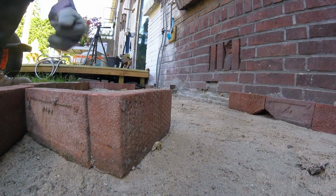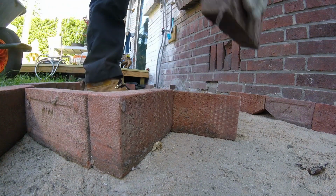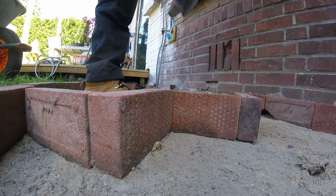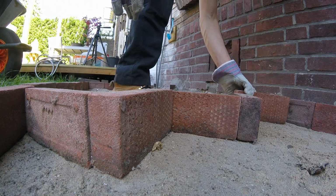The pattern is the center line of the whole job, and to check the sides how much you want to cut the bricks there. Sometimes you want to start with a middle line or a middle row to get an even cut at the sides of the whole job.